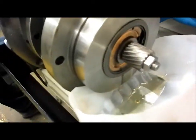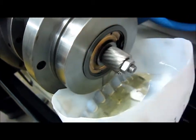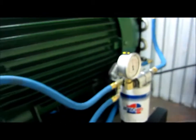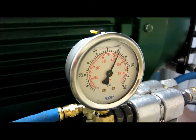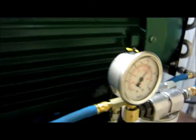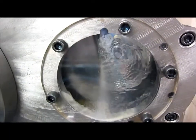See a nice pin spray on the gear. Here's some oil coming out of the turbo. The shaft is nice and free. Oil pressure is coming up now. Oil pressure is going to stabilize at 75 PSI at 30 Hertz. We've got a good strong stream spray of oil.